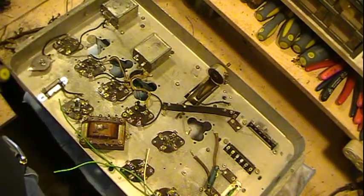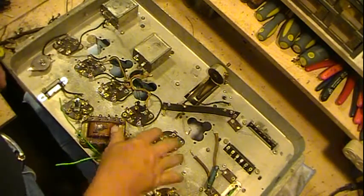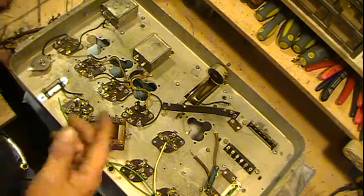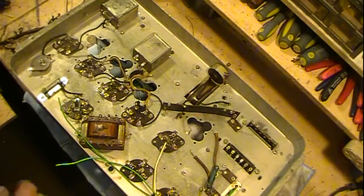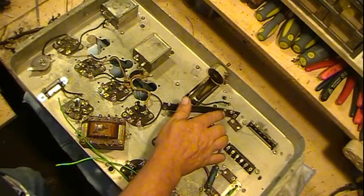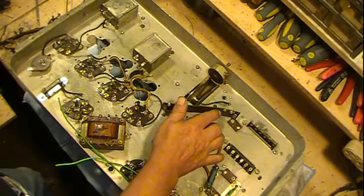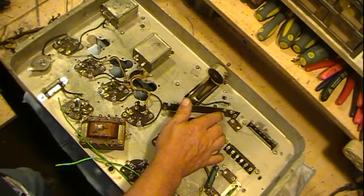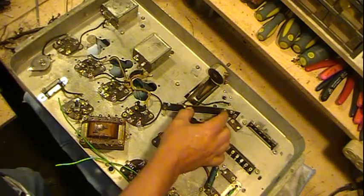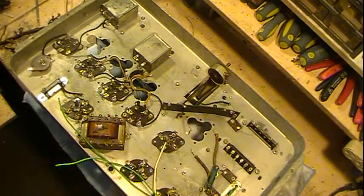All I had left to do is this socket pulls out, the speaker socket pulled out, it was unscrewable. So you only had 4 sockets to actually drill the rivets out, and that's what I ended up doing, and then just pop riveting it back in. If this gives me troubles, which I don't think it will, since this wire seems to be able to be soldered, it had a little drop of solder on it, which is solid, I'll add a little solder right at the riveted-on connections. The wire itself is in good shape.